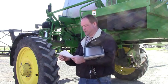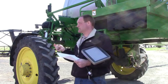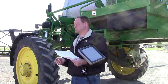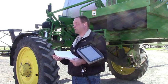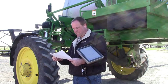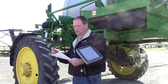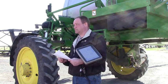A couple other things — the eductor is on the other side. When you're running the eductor, if you just have the machine at an idle and you have water in your tank already, it's basically going to be running backwards and back flushing into your eductor. So you've got to make sure you kick your RPM up on that to where it sucks it into the tank right. Paul will talk about the auto boom setup and some things to look at on it.